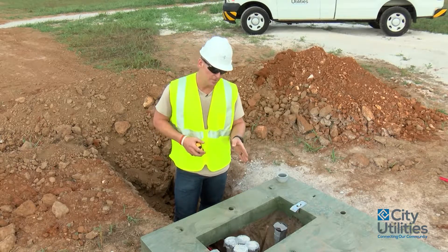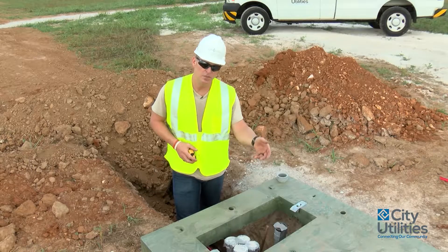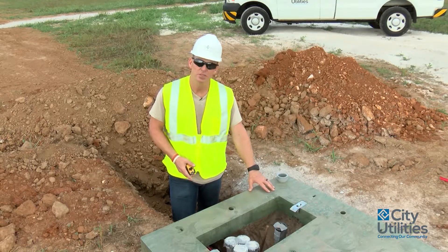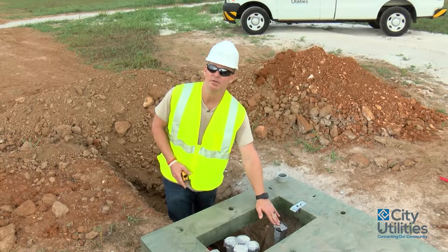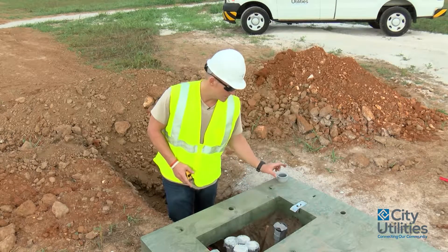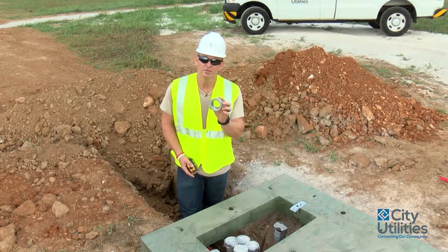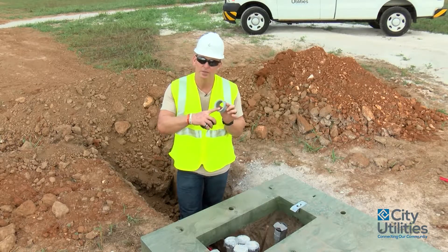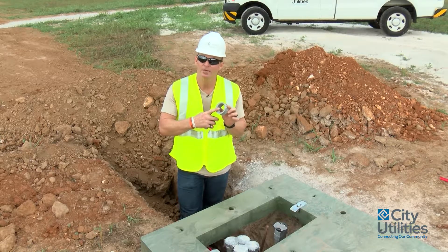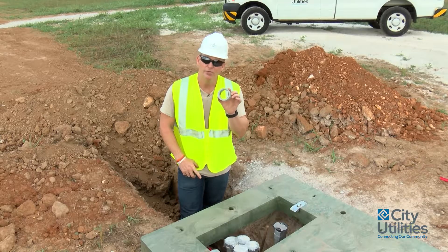Back to the transformer: we have the 36-inch radius elbow coming into the left side, and on top of that the contractor has used an FA fitting to make adjustments for depth. The pad is just a little bit low in the ground right now. We also have to have a two-inch bell ring fitting on every primary riser location. This fitting has a rounded lip that allows the wire to be pulled in effectively without destroying the jacket or rubber coating around the wire. Every primary location will have this installed.